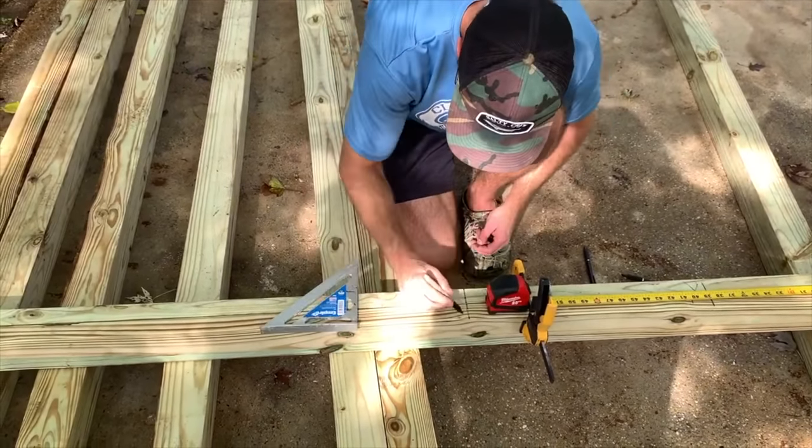And then I'm gonna position the second piece of rake drip edge on top of the first piece of rake drip edge so that I have a 6-inch overlap, and also so that the front near the ridge is perfectly flush with the ridge fascia board as shown. Once I have everything in place, I secured it with a nail, made sure that the two pieces of rake drip edge interlocked properly, and then secured them in place every 12 inches on center. Repeat this exact process for the other rake side of the shed.